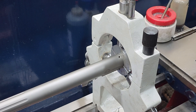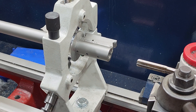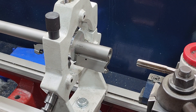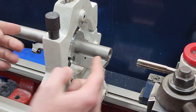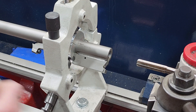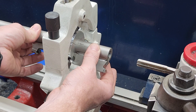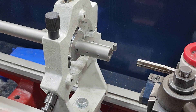What I'm able to do with this is support the breech end to be able to work on the inside. I originally had this set up with a Viper action fixture, but I didn't feel it was strong enough with the barrel sticking out about a foot from my spindle. I had three thousandths runout in that Viper fixture because it was about six or seven inches out from where the fixture would have been. It's really hard to center that up when it's that far out, because you move one jaw and it moves both.